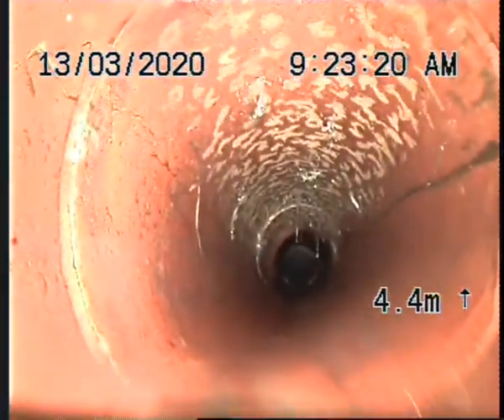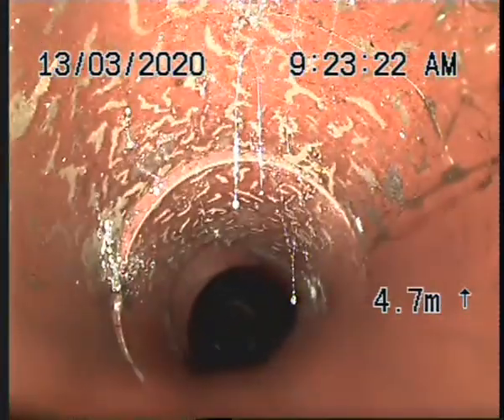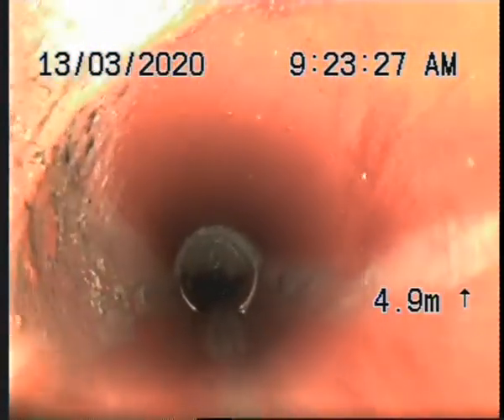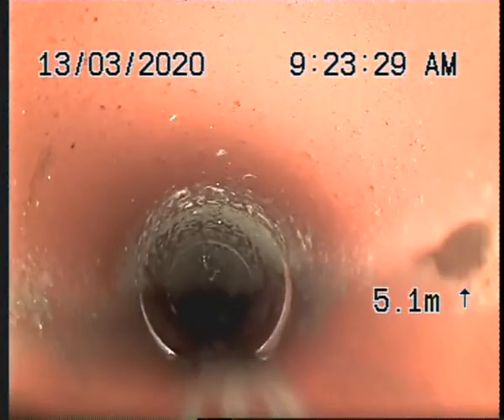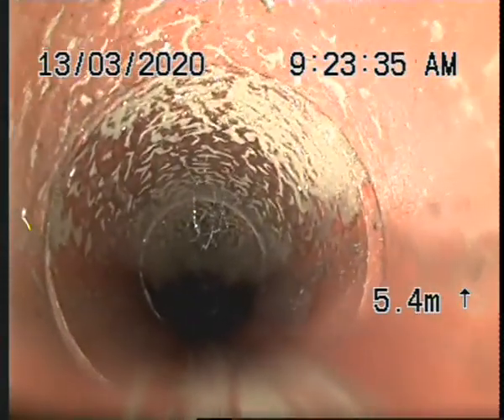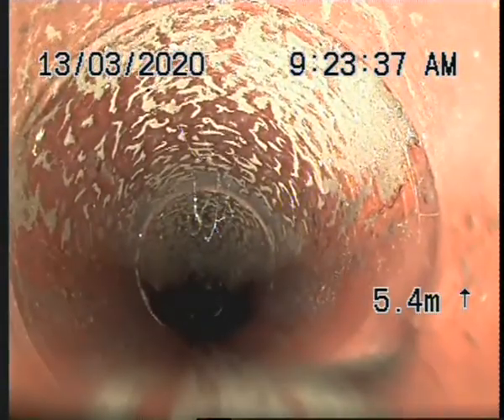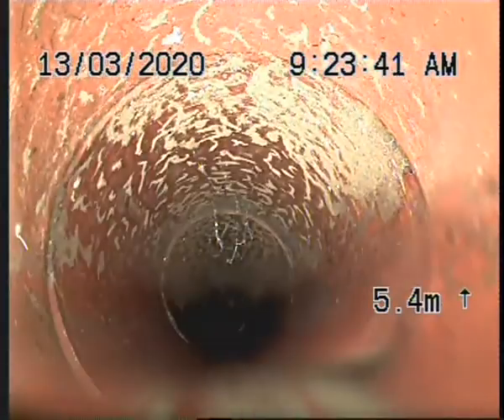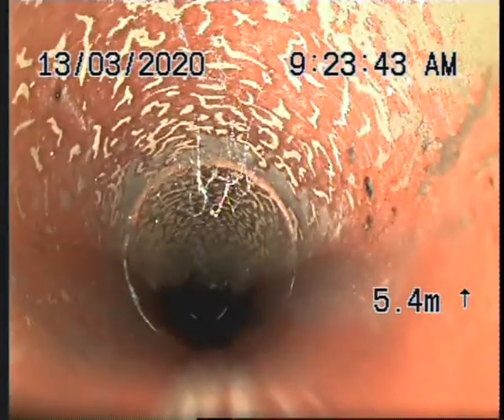The other connection for the gully trap is the kitchen one. That is the kitchen connection right there. And I think it's this joint here, because when we watched it last time, we were able to watch moats spin around in it and run out right there on the right-hand side. At about four o'clock you can see there is a bit of damage. So I think it's there.